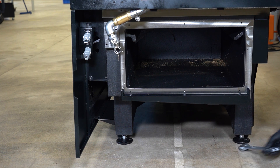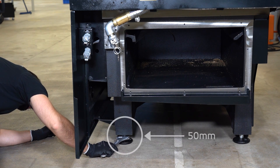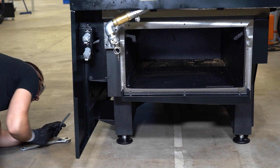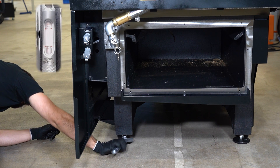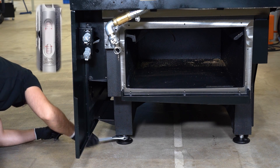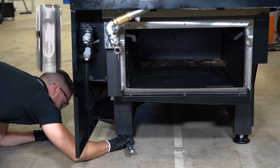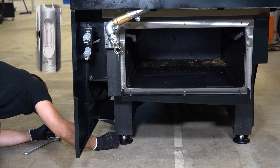When this is done and the 50mm are reached, you can now pass to the other side of the machine. Repeat the process with the other foot — 50mm again. Then you fine-tune the level by checking the precision level placed on the S4 saddle. The bubble should be at the center of the gauge.